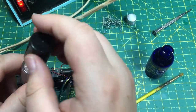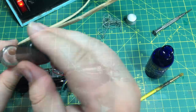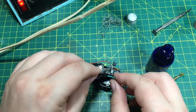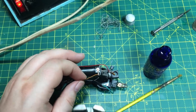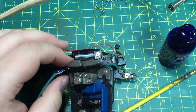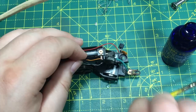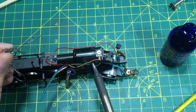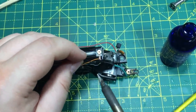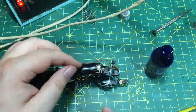Just in case, I'm going to put a tiny amount of nail polish on those joints — think of it as liquid insulation. For the black wire, if we'd had our thinking hats on we'd have put the heat shrink on first, but it's okay because we can break into this wire using the bus wire strippers. We're going to part the insulation and slide it back without actually breaking the core of the wire, then tin that — it's a really good way of adding in extra connections after the fact. And there we go, we've got our little Y-join.